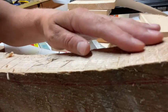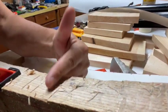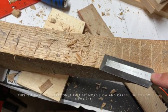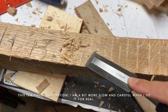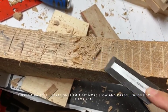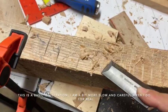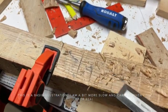What I'm doing right now is: I cut in to the pieces and then cut along these lines. These pieces are actually used to chisel and knock the waste out, and that's why these vertical lines remain right here. Then what I have to do is smooth this all the way down with chisels, with sandpaper, with planers and things like that. After another four hours or so of effort, I'll have this piece — stem two.